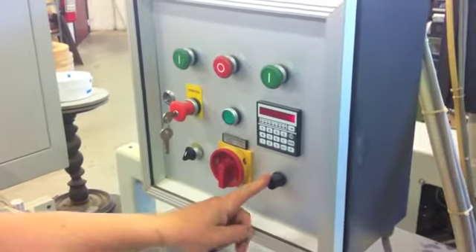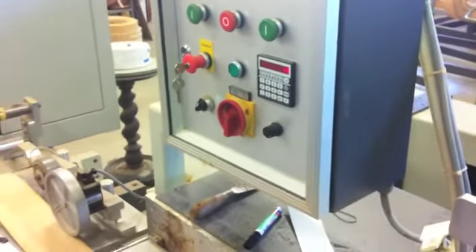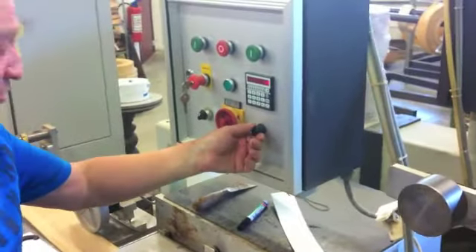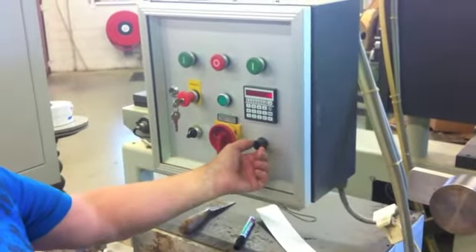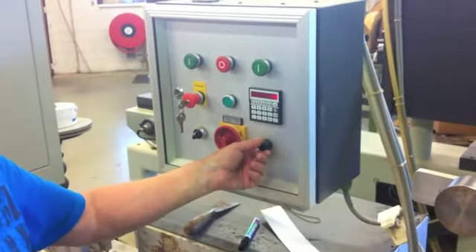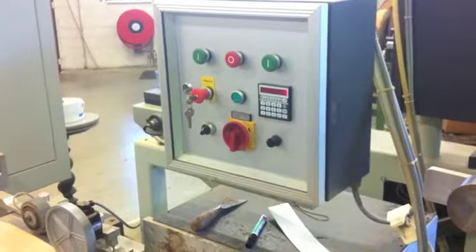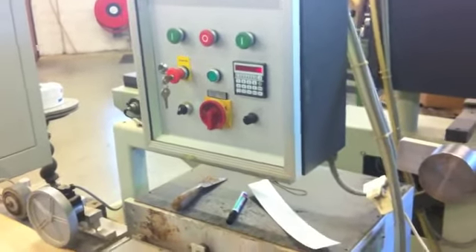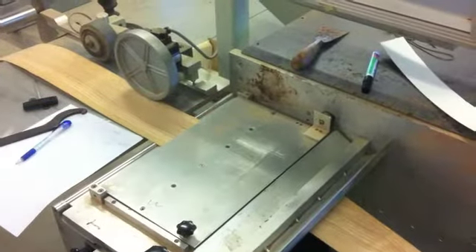Be sure that this one is on zero. At the beginning of the roll you can go to the maximum. You must check if the veneer has a good structure. Not too low — because then you have burned edges — and there is no diameter compensation. After the roll starts, you must lower the speed, otherwise it goes too fast. It's possible to run at full speed to 200 meters, but if you have a breakdown you destroy your whole master roll. Below, you have two slots for the exhaust of the dust — it's not only for dust, but also to cool your saws. The direction of the saws must be anti-clockwise.